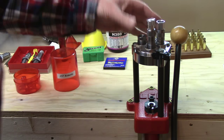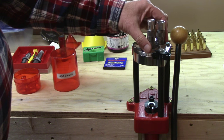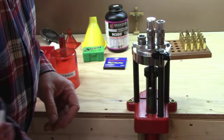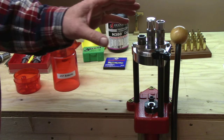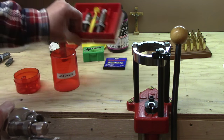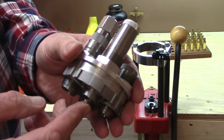Some people are concerned that the turret floats up and down and that this will lead to inaccuracy — it will not. There is a positive index point, and it floats only upward to the point where it stops. All your measurements are taken from an absolutely fixed position at the fully extended position, which assures you never have issues with imprecise die settings. Trust me, it works beautifully. There are other dies on here — I've set these aside because I really don't use the standard full-length sizing die anymore, since I'm using just one rifle.